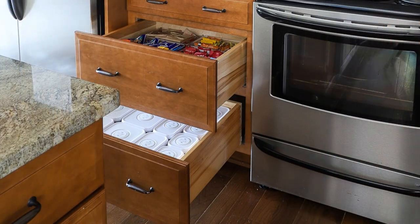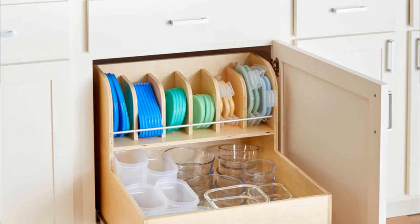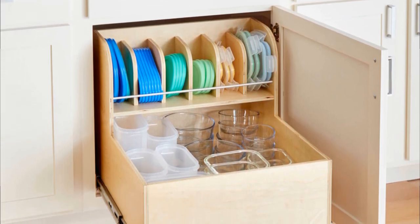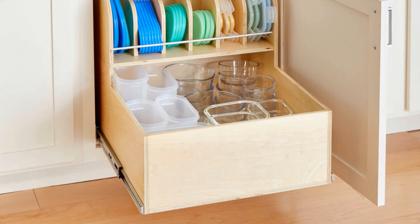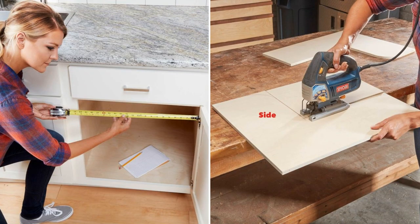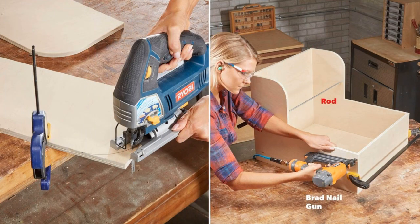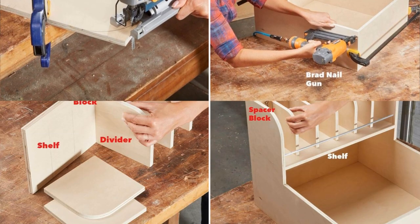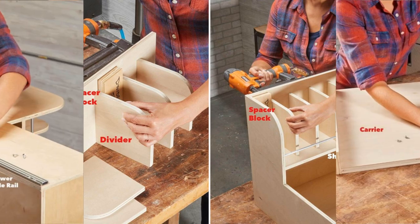Number 2: Build the rollout cabinet. First, you'll need 22-inch full-extension ball bearing slides and a one-quarter inch aluminum rod. Measure the cabinet opening — most base cabinets are 23 inches deep and may fit this container storage cabinet rollout. If the distance from the face frame to the cabinet back is less than 22 inches, you'll need a shallower rollout and shorter drawer slides.